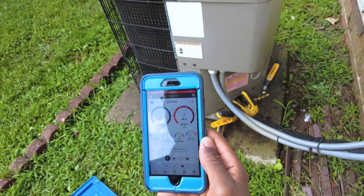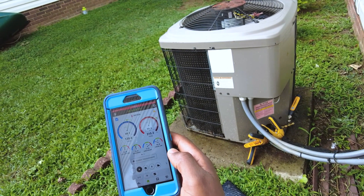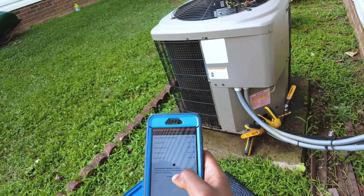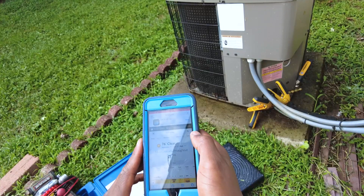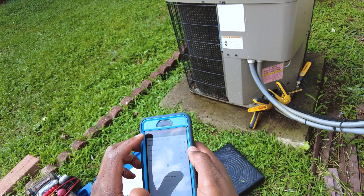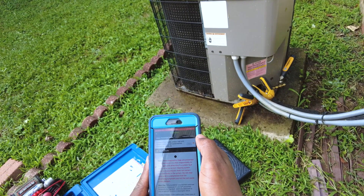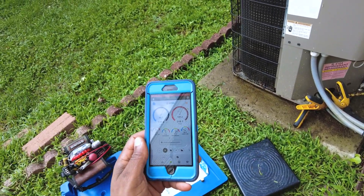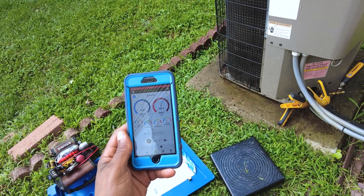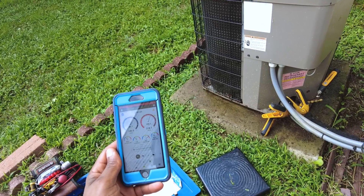Like I said, it's got a leak — it's an older system — so a slight overcharge is probably doing them a favor. Liquid line is still a little bit cool. I think my outdoor temperature might be high anyway — it's still 92. That subcooling is a little bit high, but it's going to come down here shortly as the coils dry the rest of the way and the system starts to equalize across the metering device.